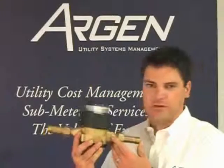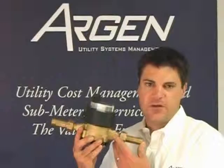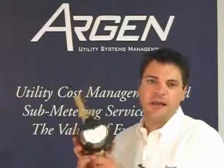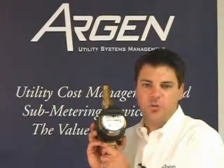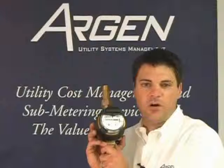The Amco C700 Insider R meter is a brass-bodied multi-jet meter installed in each apartment unit of your property. The meter measures cold water in US gallons and can be installed to capture the total flow into the apartment unit, which is called total capture, or it may be installed on a cold water inlet in the unit's water heater, which is called hot water allocation.